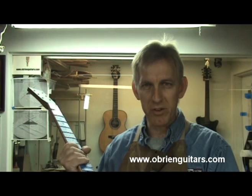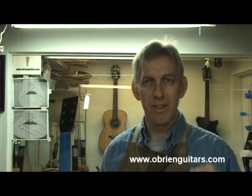So we just finished doing some wet sanding. I used 600 grit. I've talked to you about that. It's now time to go back to the spray booth, hopefully for the third and final time. This time when I go into the spray booth, you're going to see me thinning back the lacquer. That can cause a problem.